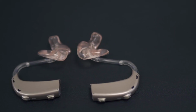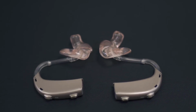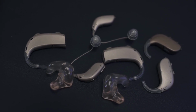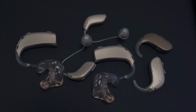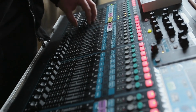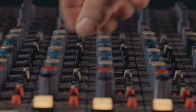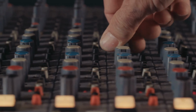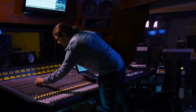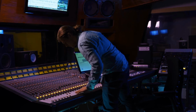The final and most important adjustment needs to be made with the input of actual hearing device users in the hearing loop field. However, the programming of the user's hearing devices needs to be verified prior to this step. Sound system adjustments and technology is outside the scope of this video. If the installer does not have experience with sound systems and the facility doesn't have their own expert, it is prudent to make arrangements with a reputable sound technician to help connect the first few installations.